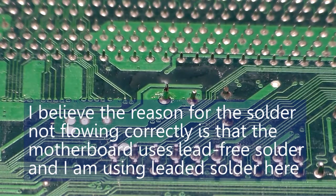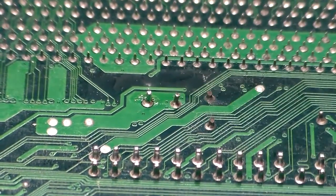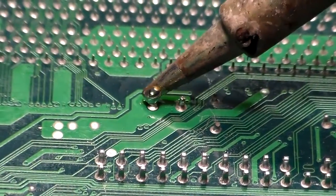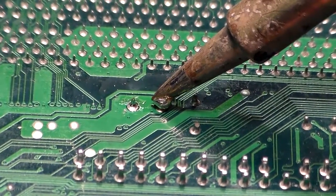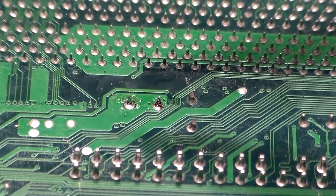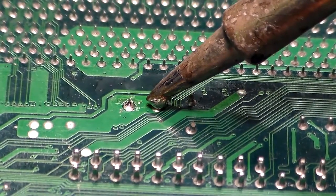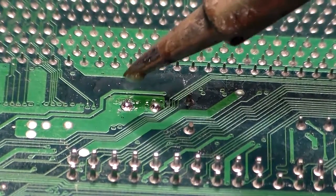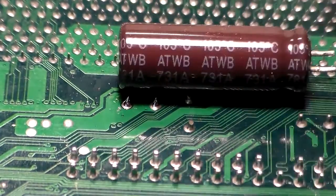I'm not getting a good heat transfer — the possibility is it's oxidized. What I'm doing right now is I've got my hand underneath holding the capacitor, and as I heat up the joint I just gently pull one side out at a time, just a little bit at a time. Definitely don't want to break anything and the capacitor will eventually come out — like that. There's our capacitor.